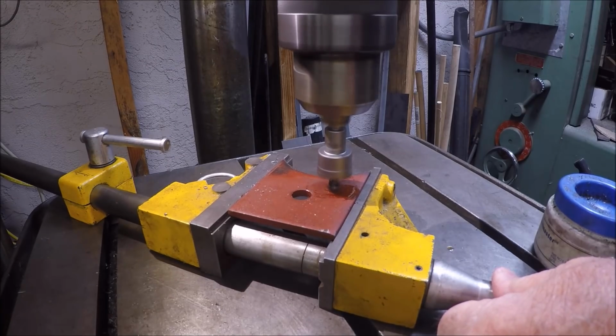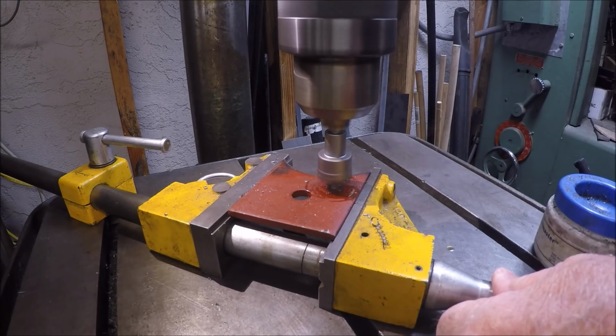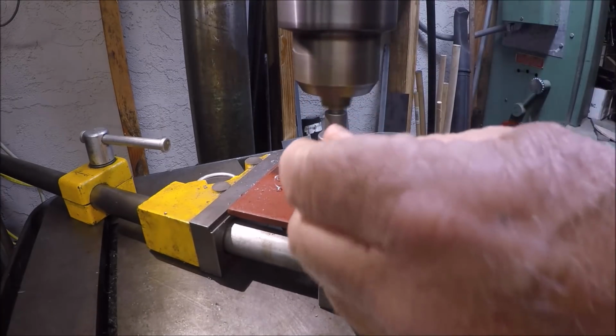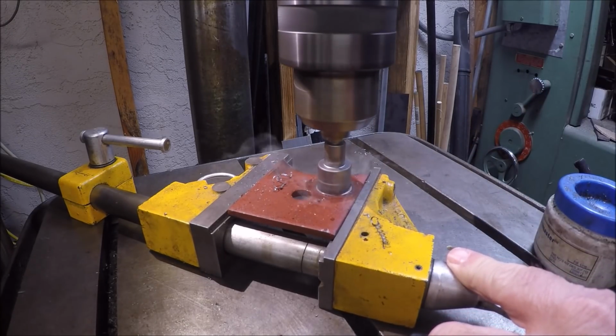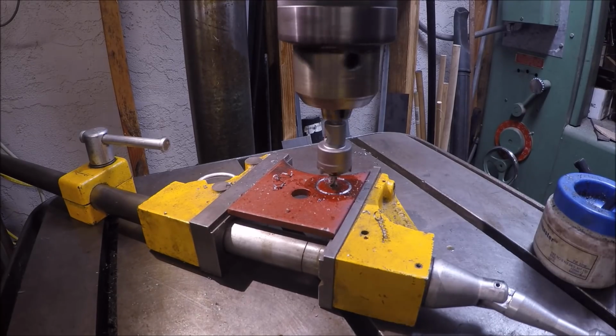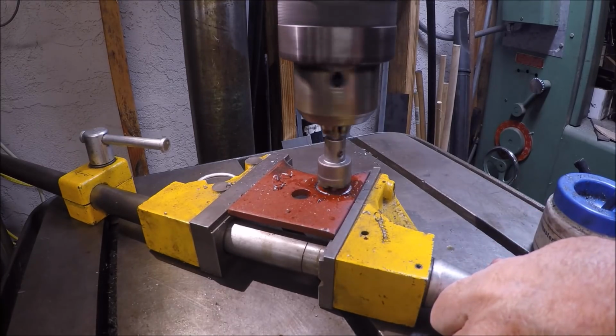Okay, over at the drill press, I've got a piece of quarter inch plate in the float lock vise. I'm talking about feeds and speeds here. It's basically a 1 inch diameter hole saw. If you look at a drill chart for a 1 inch drill in steel, it should run at over 400 RPM. So we're going to give it a shot here, starting at 400 RPM, and it really works well for the pilot drill. Of course, the pilot drill is much smaller, and it needs the speed to penetrate the plate there.